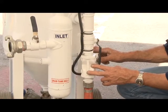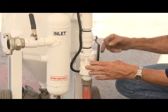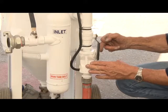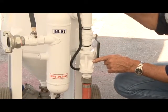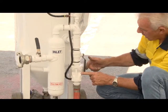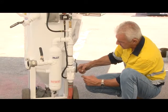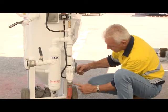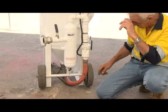Now an auto air valve — what that does is, from the diaphragm, push or remove a piston inside here off the seat. So in this case, when you activate the dead man, the diaphragm opens and allows the piston to remove off the seat. Then the air can travel down further, down the pusher line to another valve on the bottom called a Thompson valve.